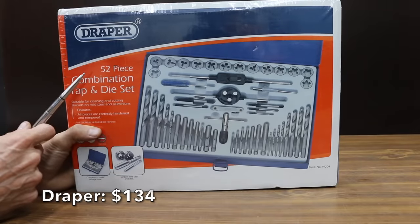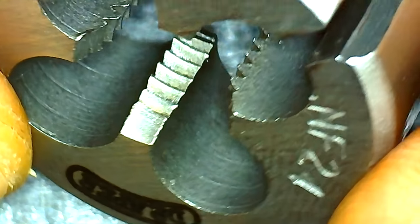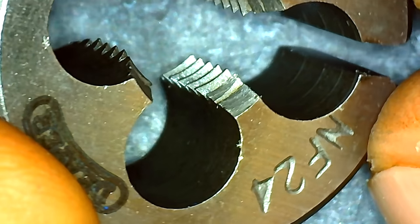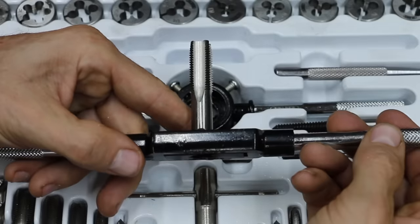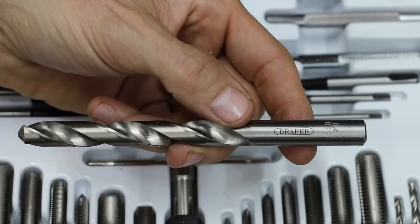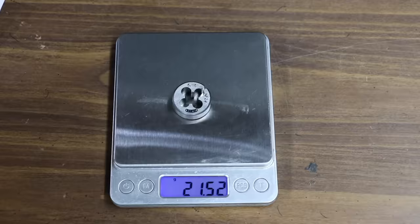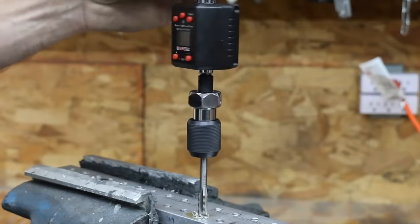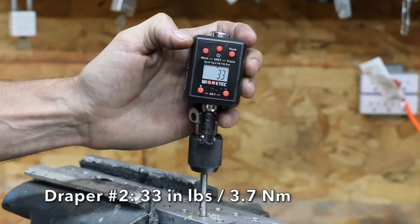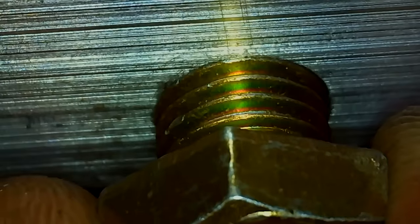At a price of $134 is this Draper 52-piece combination tap and die set. Unfortunately, the Draper kit doesn't have a 5/16ths with an 18-thread pitch, but it does include a 24-thread pitch—definitely not a perfect apples-to-apples comparison, but let's test it anyway. I believe it's made in Europe. It's made of high-carbon steel, supplied with correct drill bits for tapping, and manufactured to EU standards. The Draper tap weighs 14.71 grams and the die weighs 21.52 grams. The Draper made very easy work of tapping the threads at only 39 inch-pounds on the first hole, 33 on the second, and 38 on the third, for an average of 37 inch-pounds. The Draper also has the least amount of slop—though again, not a direct apples-to-apples comparison with a 24-thread pitch tap.